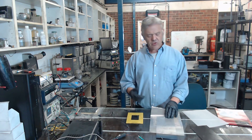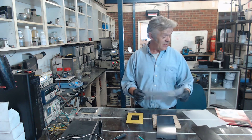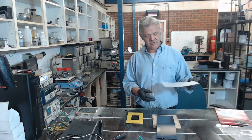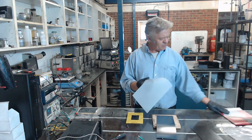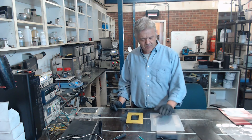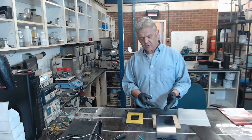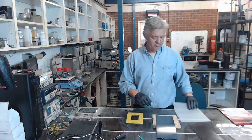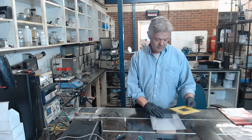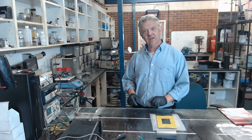The other improvement: the strength of the electric field is related to the distance between the two plates. The original plastic separator was actually pretty thick. Since we're putting up to 40 kilovolts through this we need something that can withstand that, so I found ordinary tracing paper — about 60 micrometers thick instead of 120 micrometers. I'm going to use that as the separator. I could also do a double-sided window for sound from both sides, but for now I'll just use the thinner separator with the better mechanically-adhered plastic film, then connect it up.